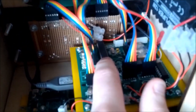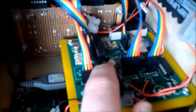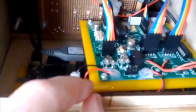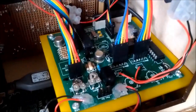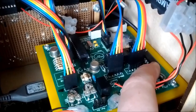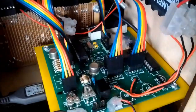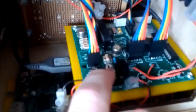It would be difficult to explain everything on the main board, but it is just an Arduino. There's another DC-DC converter, and there are a lot of level shifters — you can see one there, and the rest are under that hot glue. This is all the audio circuitry. That's the digital potentiometer that goes powered directly from the Raspberry Pi. Behind these headers there's just a relay which controls the amplifier power. These two potentiometers set the contrast and backlight brightness for the LCD.